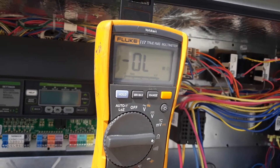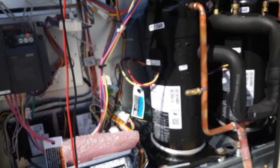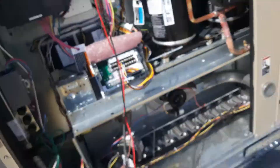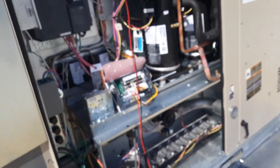I've got an open — that tells me that one of them is bad. One of them is not wired up, or one of them has the cover off or the head is out of it. So I'm going to go out there and troubleshoot that, and I'll meter it at the device itself and manually short it out. I've already found two like that so far.